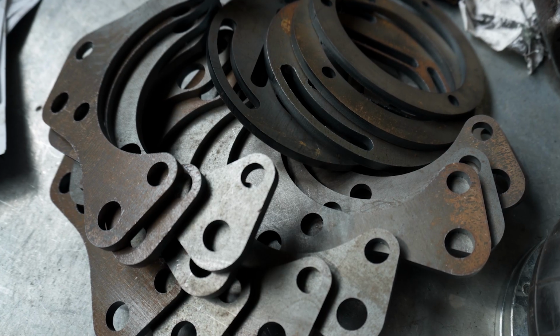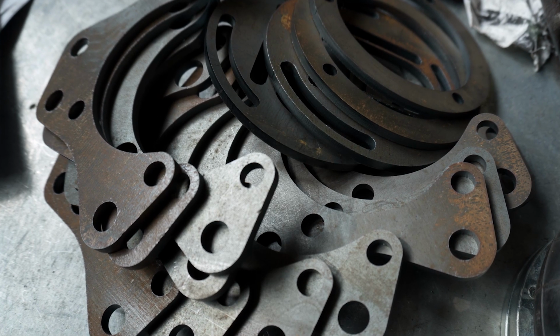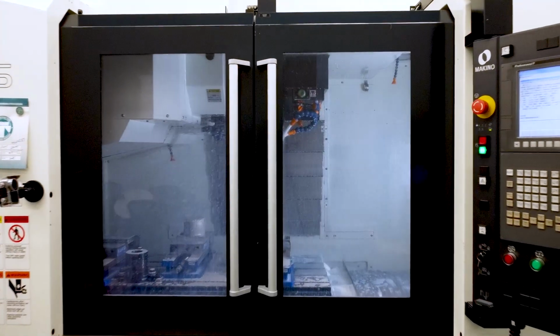Rust and coolant. Well, first, we're going to talk about the 2 places. One, rust can be on your part. Makes a bad part, scrap, rework, not a good thing. But the other one is you can have rust on your brand new machine after just a few months. Nobody wants to see a couple $100,000 machine or $1 million machine all of a sudden turning into a boat anchor. We don't want that. The wrong coolant or the improperly maintained coolant can cause rust. That is an expensive boat anchor.